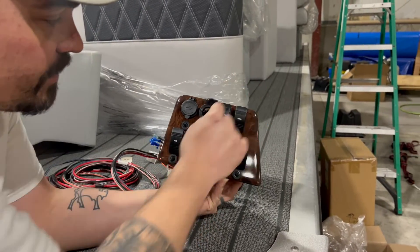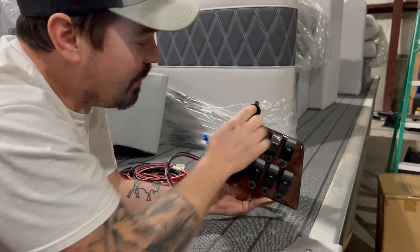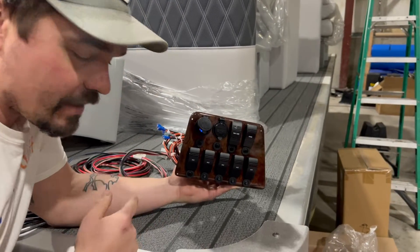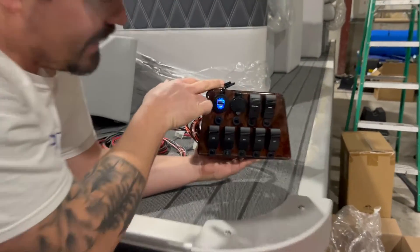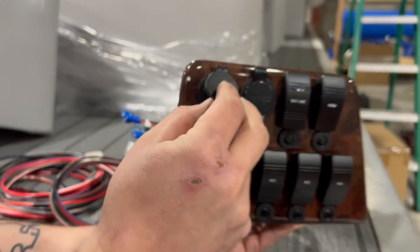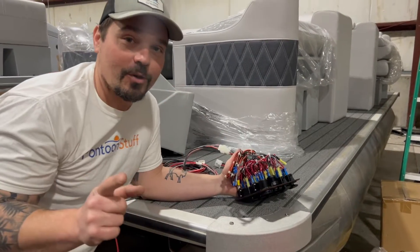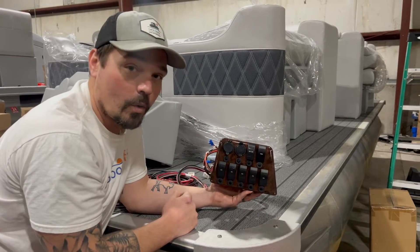You won't see anything on this charger but that's live. This is what bothers people, me included. We've got a great little USB charger there, but the second I plug my battery in or turn it on or forget to turn my battery switch off, this is going to stay on. It's a teeny little LED - I get it - but eventually if your boat has to sit for a while between uses, that could drain things down. If you left something plugged into it, definitely would drain things down.